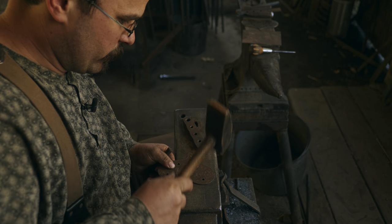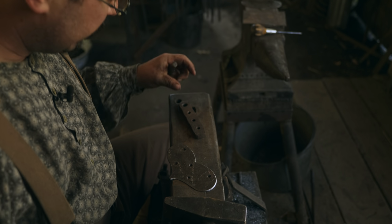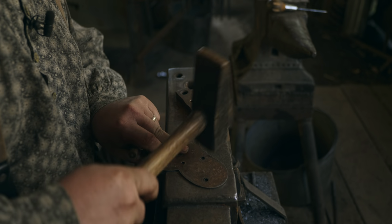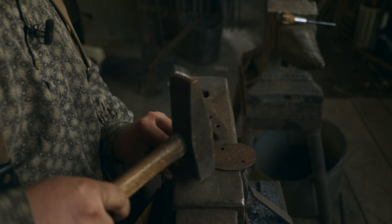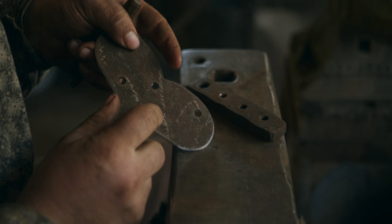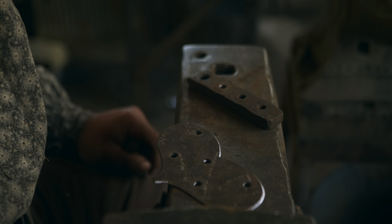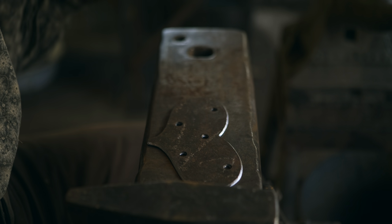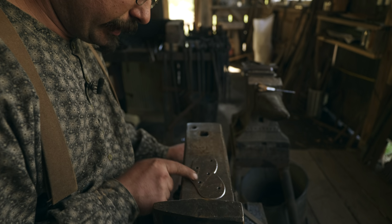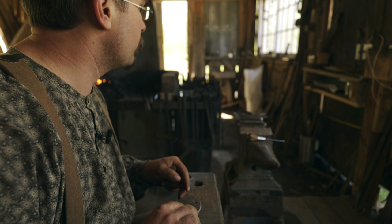So punching from the side of the plate that's going to be the face using a fairly loose fitting bolster results in what I call a rag around the hole. And hammering that rag back in to the hole gives you a natural countersink to the hole. It's not a lot, but it's more than enough to securely hold the head of a countersunk screw. And these will be just perfect for number 6 or maybe number 7 countersunk, traditional countersunk screw, straight slot screw. And I may go ahead and clean the holes up with a countersink bit just to make sure that the fit is perfect, but it won't take much cleanup at all.